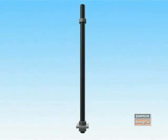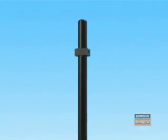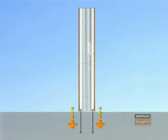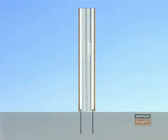Steel Strong-Wall anchor bolts come in 3/4 and 1-inch diameters, have heavy hex nuts fixed in place, and offer the flexibility to meet specific project demands. The purpose of the SSWAB anchor bolts is to transfer lateral forces from the shear wall to the foundation. This keeps the shear wall from sliding or overturning and anchors it to the foundation.